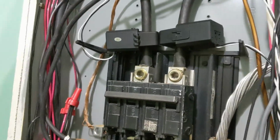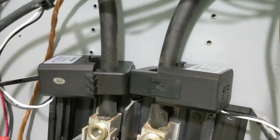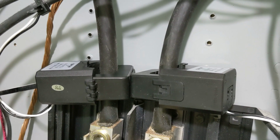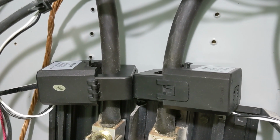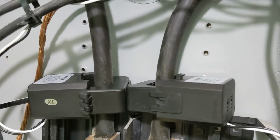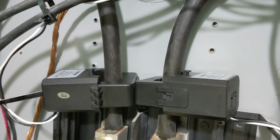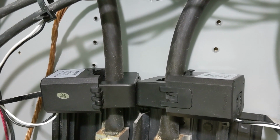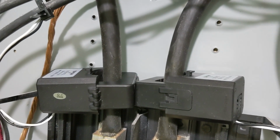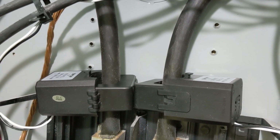All right, part of a Sol-Ark installation is putting CTs, or current transformers, around the mains, and that allows you to utilize the various modes on the Sol-Ark using grid tie sell, power, limited power to home, limited power to load, and time of use. And so these are current transformers measuring power in and out of these mains to this panel. So in sell back mode, they're not really required unless you're coordinating with a whole house generator. The other thing that I think Sol-Ark's made some improvements, that they can actually detect a whole house generator and stop the grid tie sell mode without these CTs.